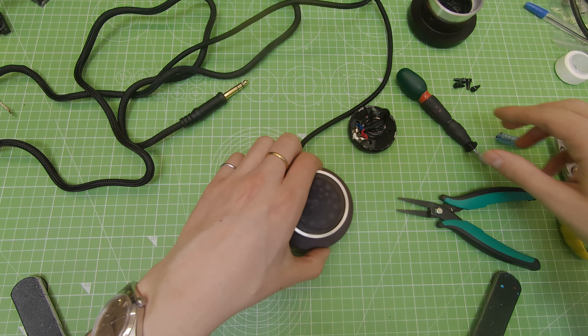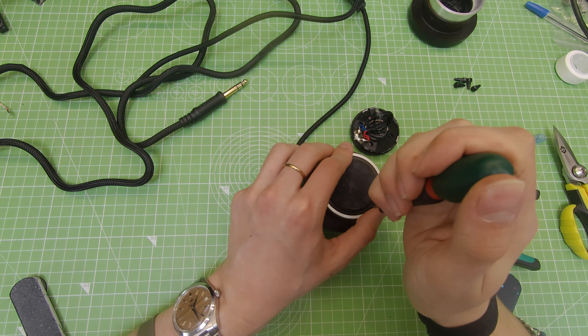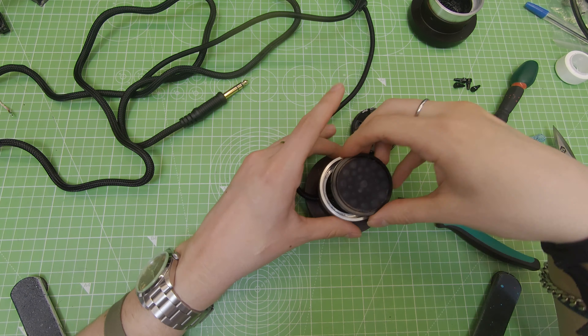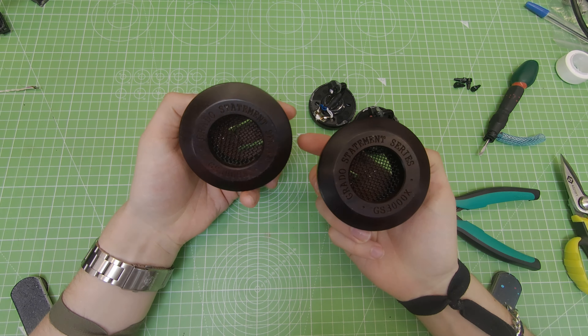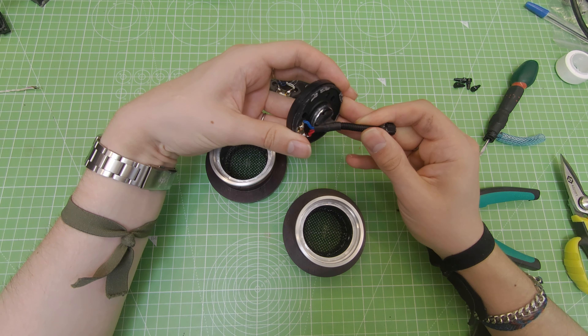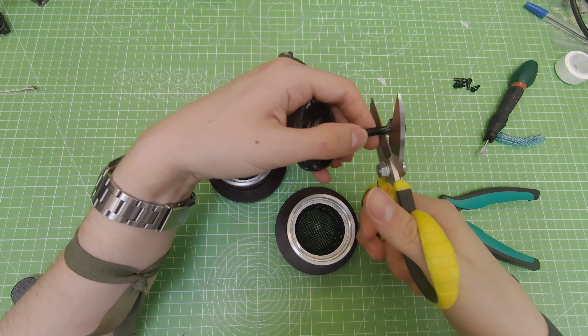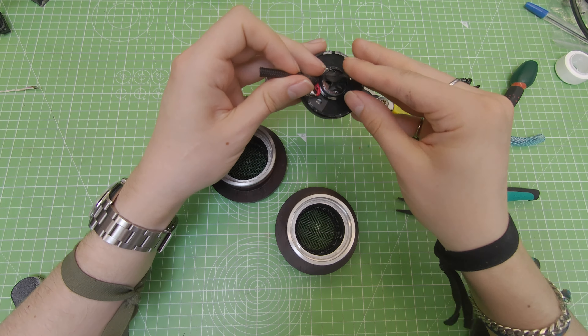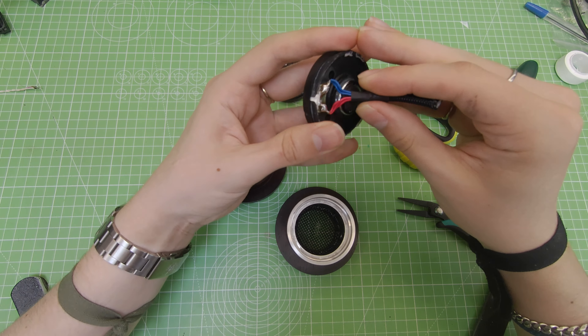You can see I've popped the drivers out. It's actually quite nice and easy to do on these ones because the glue is a bit weak, and it's also in this aluminium housing, so you can really lever on it without fear of actually breaking it. On lots of the thin wood ones, you really have to be careful because otherwise you'll crack the wood. I snipped the stock cable and pulled it out of its housing — you can see it's got a little zip tie in there to hold it in. Underneath, these ones were secured with what looked like black blue tack.